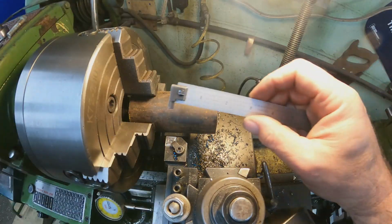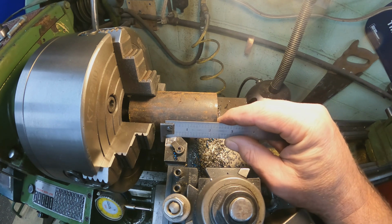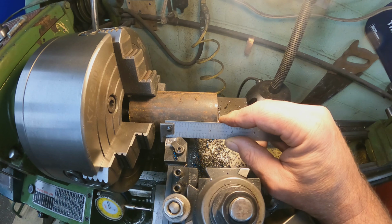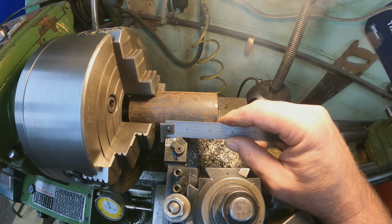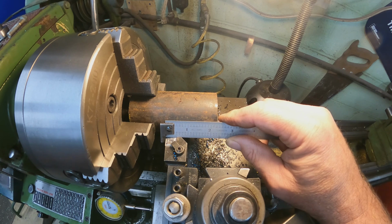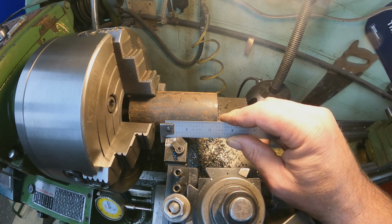So what we're going to do is scale this off to 2 1/4 inches. The pieces are 0.8, almost 0.9. So I'm figuring 2 inches plus some cutoff width, which is 1/16 and 1/16. So we're going to stick with that.